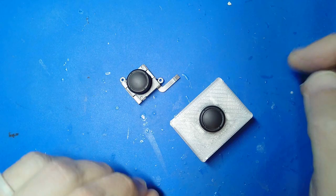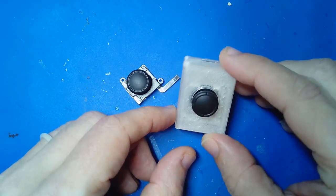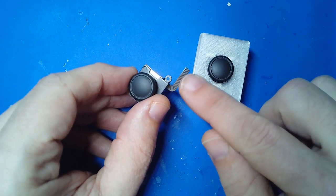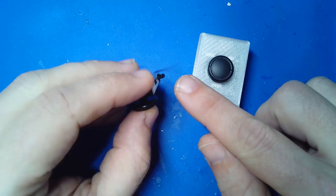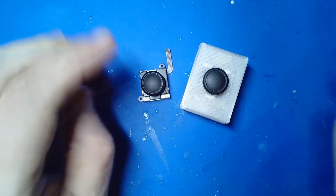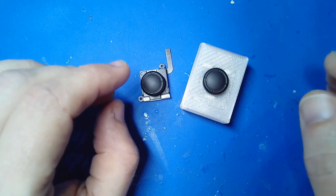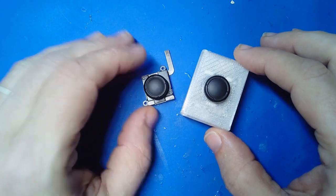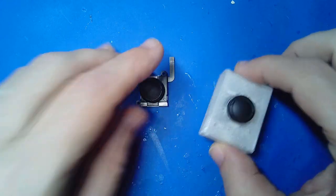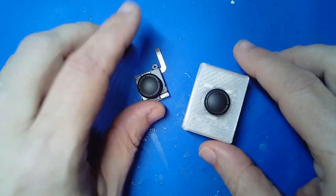The challenge I had in putting this little joystick into production was finding a way to interface between this Joy-Con replacement stick's carbon film connector and my microcontrollers. In a previous video, I showed a whole bunch of different ways I was trying and got good suggestions from people. What got this into production without me having to do a whole lot of horrible soldering was a little breakout board.